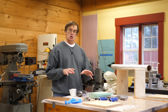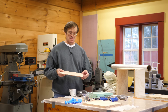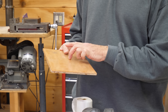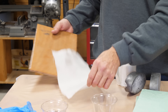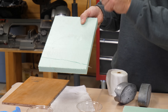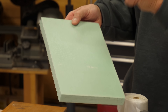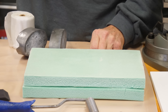You can use this to make very stiff lightweight panels. But in addition, you can also modify the surface with the same sort of technique. This is plywood — structurally a very solid, strong material, actually a composite of glue and cellulose fibers. But it tends to be very soft. So if you want something with much greater hardness — the hardness of a plastic boat — but the convenience of wood, you can simply coat one surface with the boat cloth, wet it out, and you'll produce a much harder, more damage-resistant surface. For example, if I take this styrofoam and hit it with this ball, I can make a lot of dents. But if I take the fiberglass-reinforced material, I can't damage it.